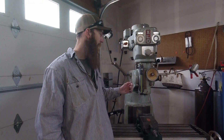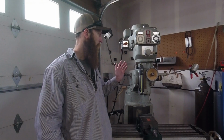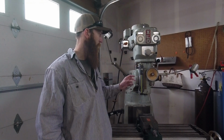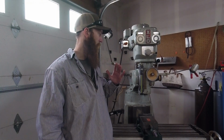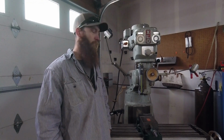I could probably tram my head with it in place, but if I was to adjust the head at any angle, I'd probably pop it off, which I could just undo the 2 screws, and since the reader head's attached with a magnet, I can just remove that, adjust the head to the angle I want, and then replace it, and it's not too big of a deal.